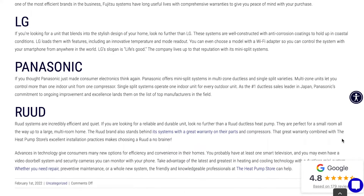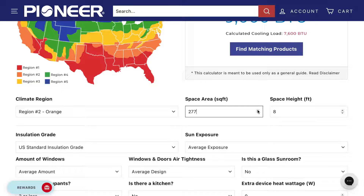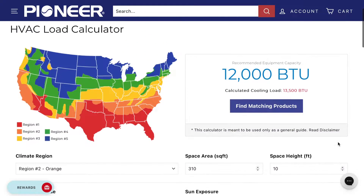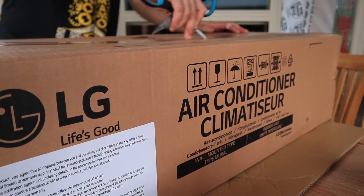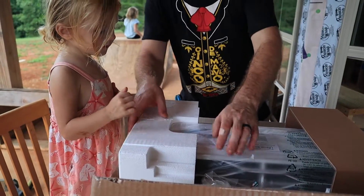When we were first looking at what type of mini split to get, we did a ton of research. We had to calculate the load that we needed for the tonnage and how many BTUs we estimated. We really wanted to get a professional to at least give us an estimated tonnage, but we could not find anybody to provide that for us, so we did it ourselves using online tools that generate a BTU usage. We took those numbers and slightly padded them to have too much rather than not enough. You do have to be careful because you lose efficiency if you go too big.